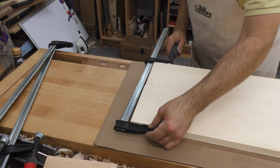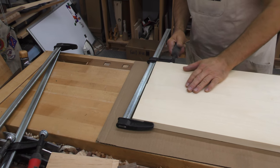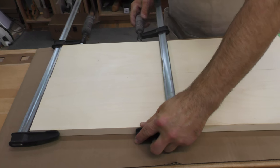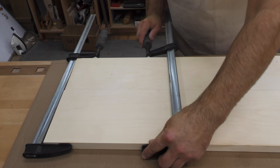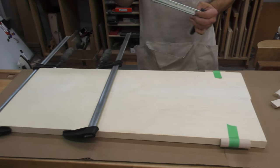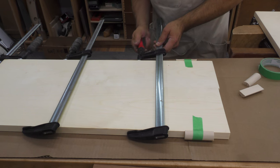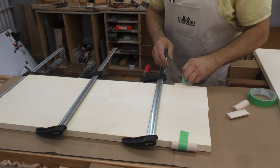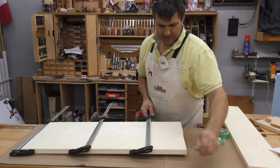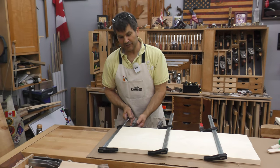Come in at the end and make sure the head and back of the clamp are right in the middle of the board. You just want enough squeeze to see a little glue coming out — not so much that you have a mess running everywhere, and not so little that you see no glue at all, which may mean you haven't applied enough. Those are the two different clamps I'd suggest, and I really favor the F-clamps.